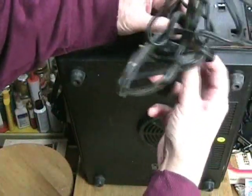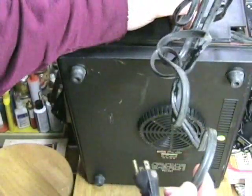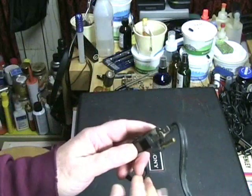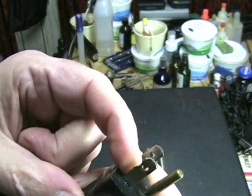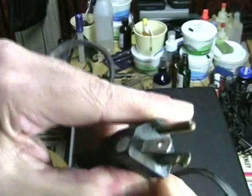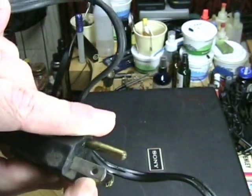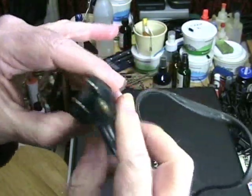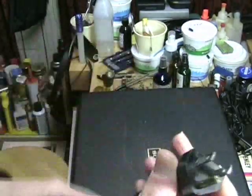This is a pretty heavy-duty power cord — it's a three-prong plug, but if we look at the cord itself, it's just two-conductor. With these old machines, you really have to check everything very closely. Something happened to the spade on the plug — it looks like it's been deliberately ground for some reason. It's also discolored and chipped up; it might have got caught in something or squeezed with a tool. It's very hard to know what's happened. People do the strangest things with their tape recorders. But structurally, it's very solid and sound, so I don't think it's going to be much of a problem.